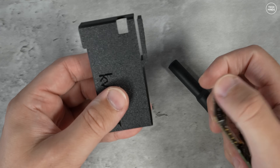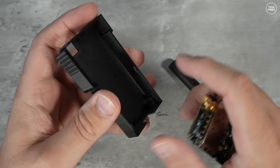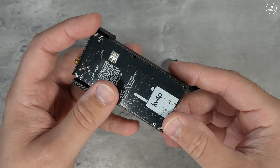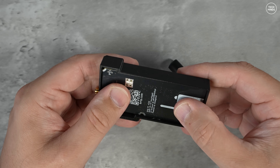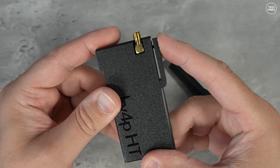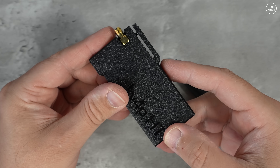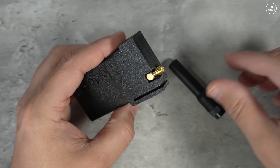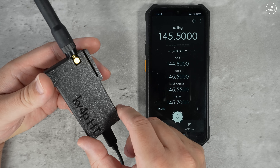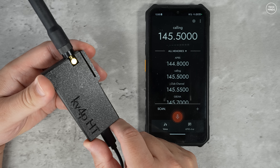On the top end of the PCB you may have noticed two shoulder buttons. If you insert the PCB into the included 3D printed case, which protects the bare PCB, you'll notice a new addition to this version 2 board — a hardware PTT button. Of course you can use PTT within the KV4P Android app, but this also allows you to press an actual hardware PTT as well. When you press that PTT on the side of the case the application goes into transmit mode, and it will still use the microphone on the Android device.